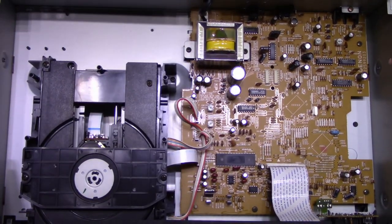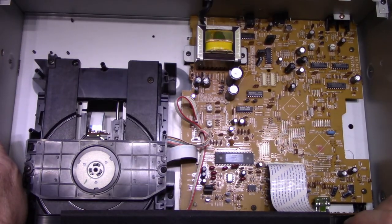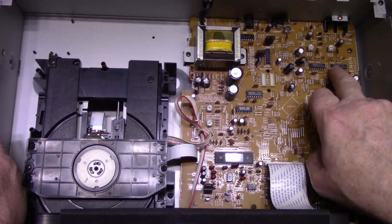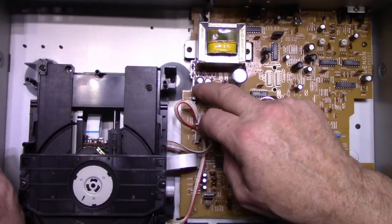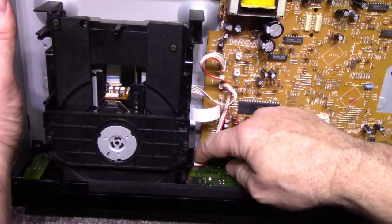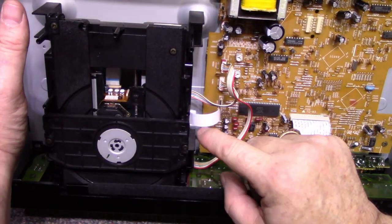So we're inside. Here it is. Pretty nice layout, pretty simple. This here is all your power supply. And this is your DAC down here. You've got PCM61Ps from Burr-Brown. Everything looks good. I'm going to check a few of these. Looks like it's getting a little cooked around here. We're looking at this mechanism here and the switch. It's probably this cable here that goes to the front and then comes back to this board. There's another cable here that goes to the optical block, and this one goes to the optical block as well.